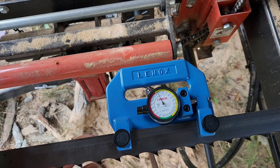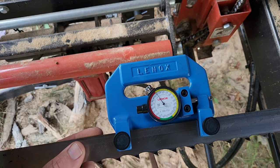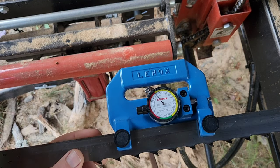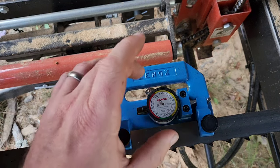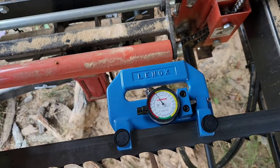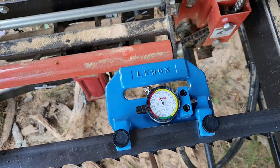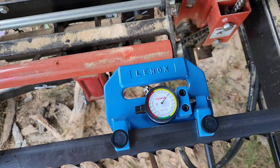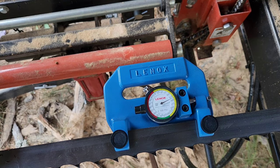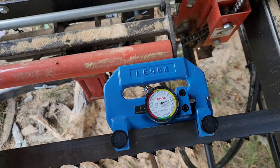It's still showing a little on the gauge. Let me give it a tap — it's off by a little bit. Interesting — as I twist the blade, it changes. Let's set this to zero and do it again. 500 PSI, 750, 1,000, and 1,100 PSI. We're reading roughly about the same — just shy of 15,000 on the tension meter.